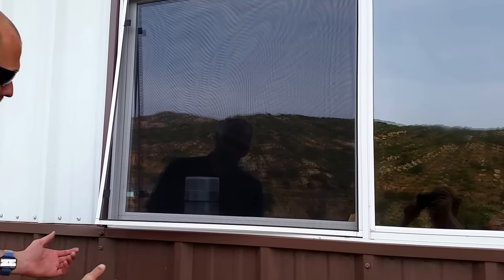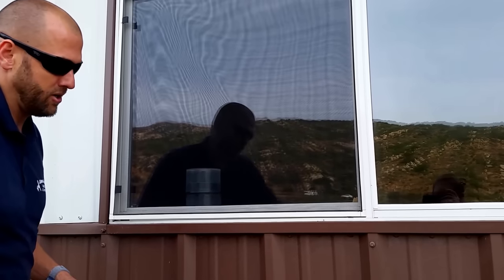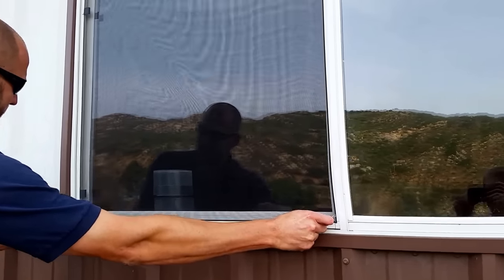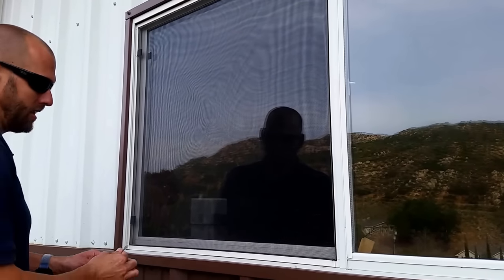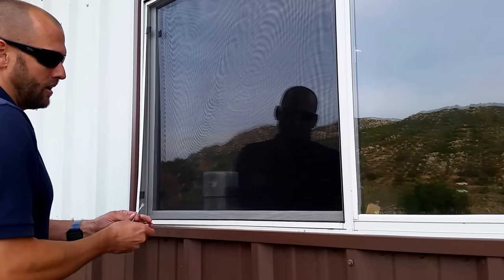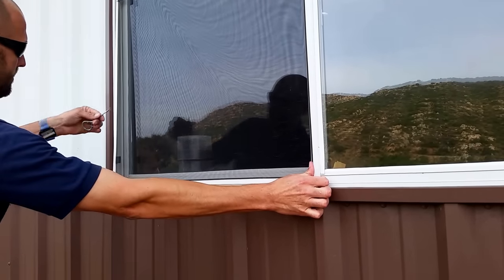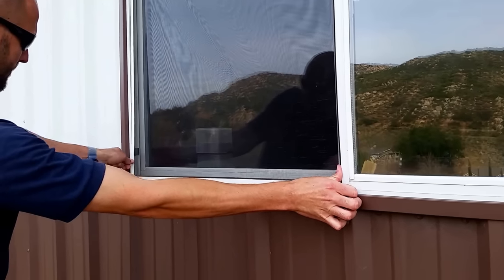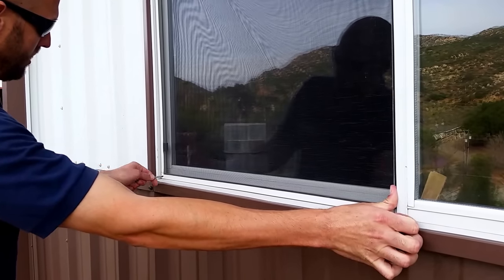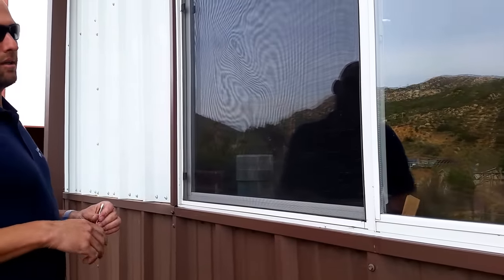So I'm at my lower spring. You get your top spring in first, your lower spring in, and now you have three corners in. All you're left with is this one. You're just going to want to push that one in. If it's not going in, you want to use your screen tool to push that spring in, and this window should slide in pretty easily. If it doesn't slide in that easily, I'll give you a quick example. I'm going to push this in with the screen tool, then take my thumb and hold it in place, then leverage it in with my screen tool again. It's actually gripping on the bottom, so leverage it in with your screen tool. If you have a bottom sill that's gripping it, press up on the top and I'm sure you'll be able to figure it out.